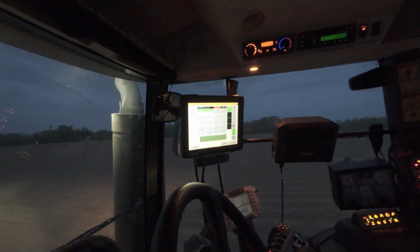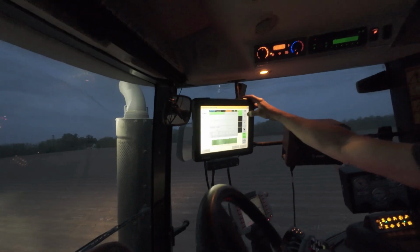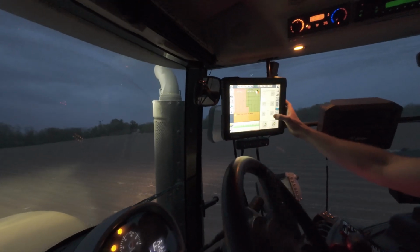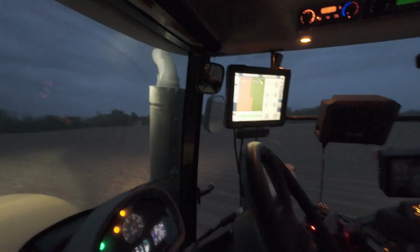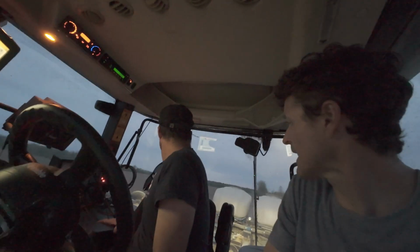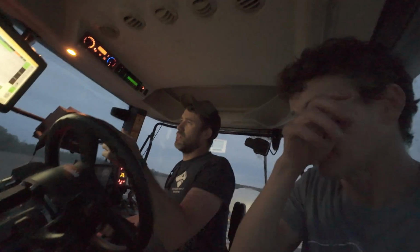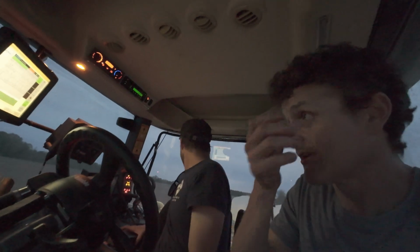Overall, 99 something singulation. I know these meters have been really good. Some of the plastic on them is a little gimmicky, but it's not broken. It's held up, and they singulate really well. And seed-wise, when you put different size seed through those meters, you don't really have to do much. Just adjust your singulator once in a while. You just roll it slightly back and forth. It takes 2 minutes, so not bad at all.